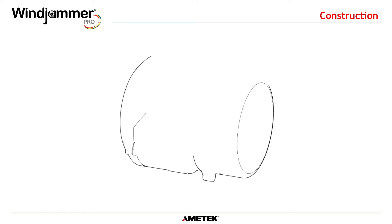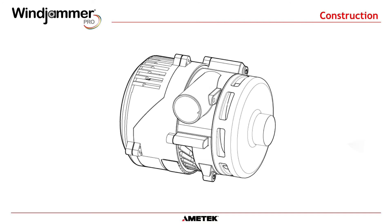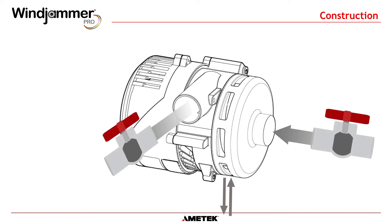The dual function blower is a very unique bypass model with the addition of slotted holes near the base of the working side of the blower. If the working air intake is blocked, air is channeled in this path, providing a suction feature. If the working air discharge is blocked, air is channeled in this path, providing a positive pressure feature. With the addition of a couple of shutoff valves in the customer system, the dual function port can be used to inflate or deflate.